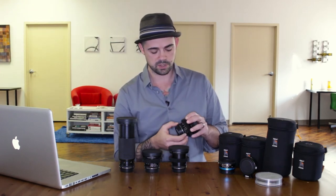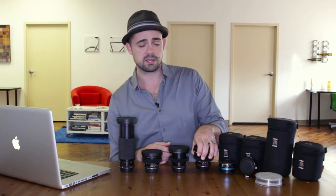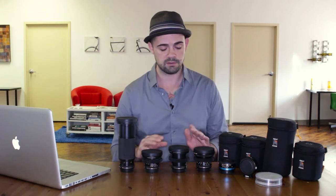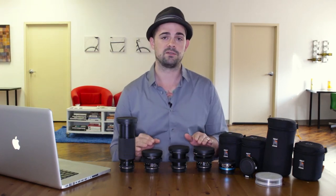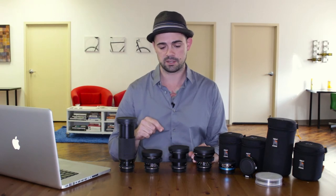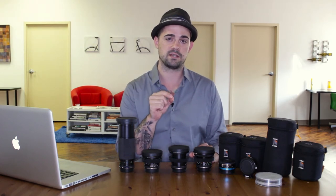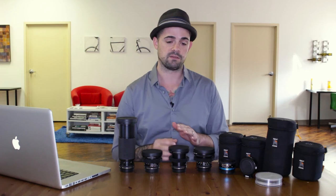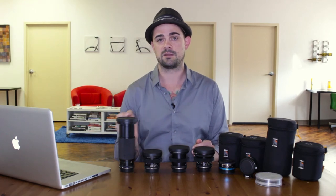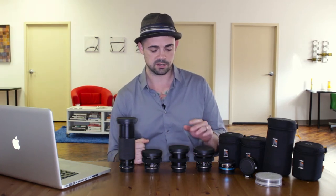They're pretty easy to do, and while we had the back taken apart, we de-click the apertures ourselves. That can be a little scary because you're taking parts of the lens off and things can get a little crazy, but I was very careful. The one thing I would recommend if you do that is buy top quality screwdrivers, because with cheaper screwdrivers, and in the 50, I actually had this happen, the very tip of the screwdriver broke off because the screws have a lot of tension. When you really put a lot of pressure on them while breaking them loose, it cracked the tip of the screwdriver off. Luckily, I was able to get it out, go buy some quality tools, and do the job right. So just heed that warning.